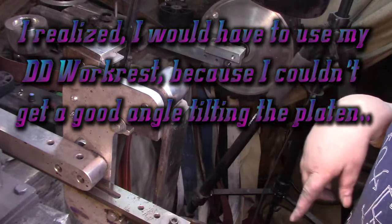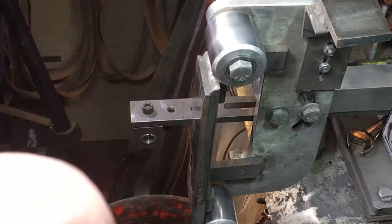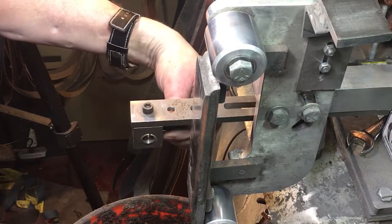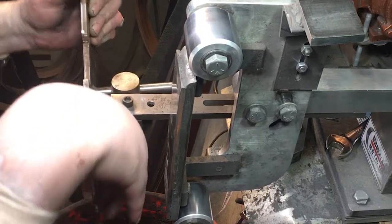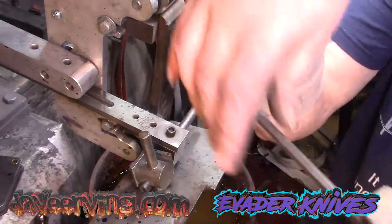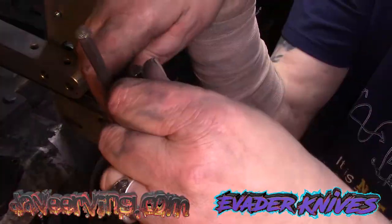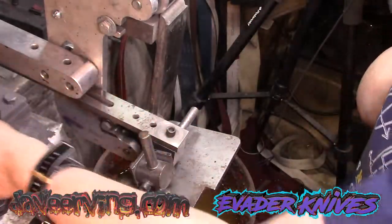Here's a little trick for anybody that has a DD work rest — not the extreme model. First you've got to turn this arm, square it up, then turn this block around so you can get to it — just up and down. Then instead of putting it in like this, you put it in from this side — this way it doesn't hit the button, you've got all this room to work. You'll want to get these T-handles — I made my own by carving the groove in and sinking it. That way I have more grip, because you only use one or two, so why buy the whole set.